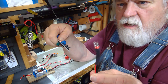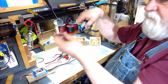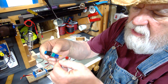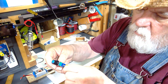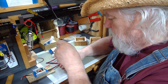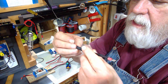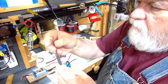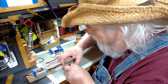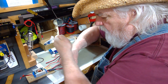To go from a bare ferrule to a finished plug: put your ferrules on just like before, then take your module and put your wires in one at a time, all the way in, and tighten the screw down. Before I do that, I'm going to take a piece of heat shrink and put it on now since I can't put it on from the other end later. Put them into the module like so, make sure they're bottomed out, then tighten that down pretty snug so you know it's in place.